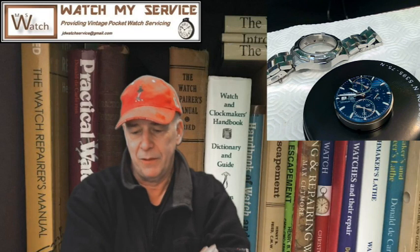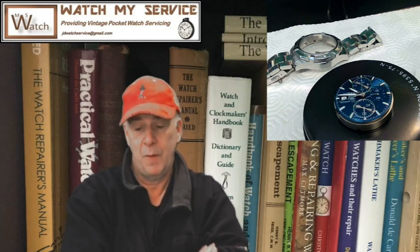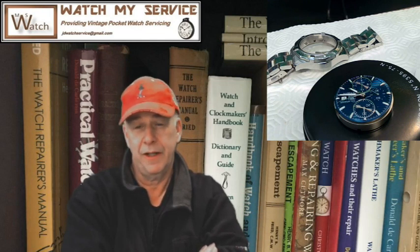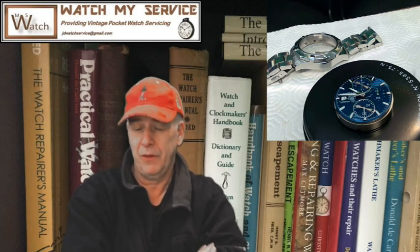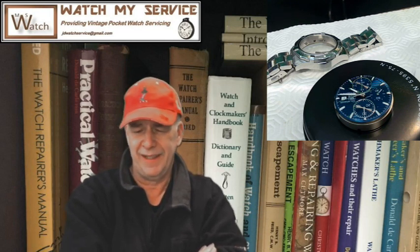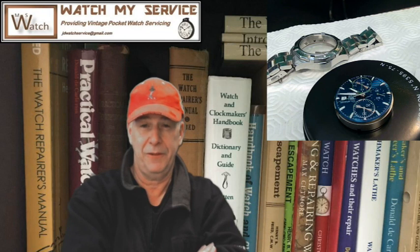So anyway, he had no hope in getting these repaired because the jeweler said, it's too much work for me. I can't do it because it is a lot of work. A friend of mine, I've done a few watches for him over the years. His name is Bori. Shout out to Bori. I hope you're doing better, Bori. I just sent him back two very high-end pocket watches that I got. One of them going exceptionally well. The other one was hard to get going from a regulation perspective, but it's running very strong. One of them was within 1 second a day or something like that with a crazy, crazy amplitude. So that was a lot of work. Had to make jewel settings on a lathe for those watches, and I had to shave down pallet bridges and crap like that. So it was a lot of work.